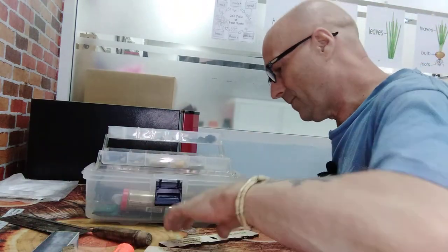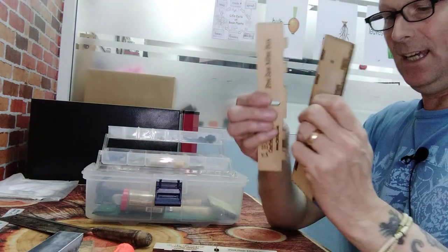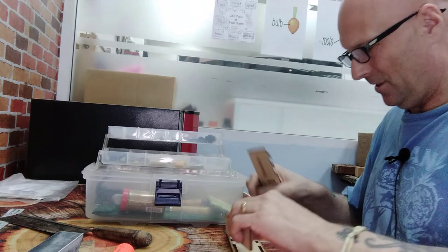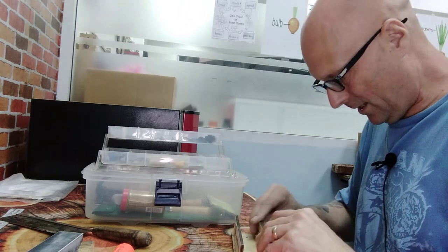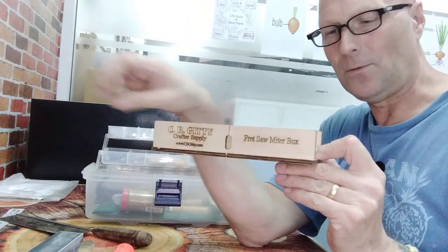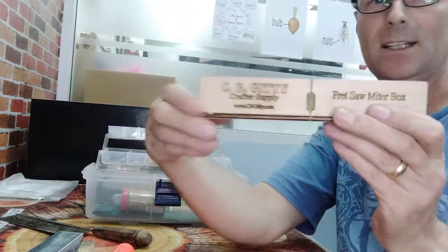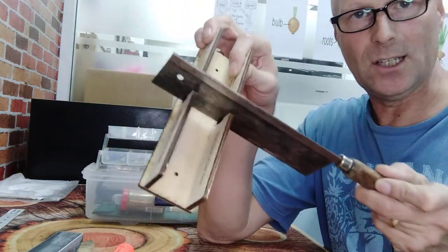And then there's this gizmo. I bought this in a kit — you slot these in either side to create a frame for cutting your fret slots. This is obviously no good for tapered edge fretboards, this is for straight fretboards. So you put your fretboard in here, and then you've got slots here where you put the saw in and cut your fret slots.